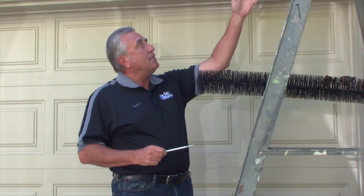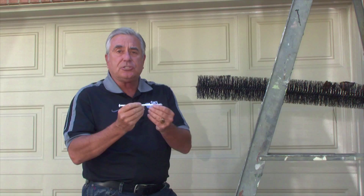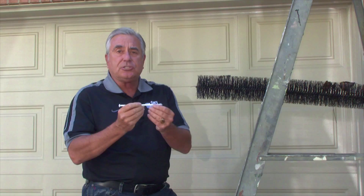So how do you fix it? This one's pretty easy — you can simply nail that nail back into the ferrule and into the house, which will tighten up the gutter. But a lot of times, especially after winter with all the ice, it's pulled away and the hole has gotten larger so the nail won't bite. They have what they call gutter screws — same length as the nail but threaded, so you can screw the gutter against the house and it's not going anywhere. So make sure to check the soffit vents and that the guttering is tight against the house.